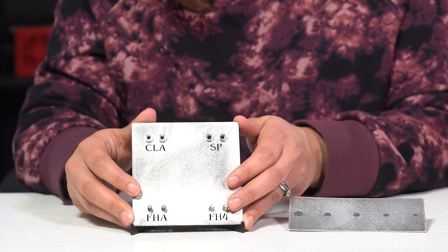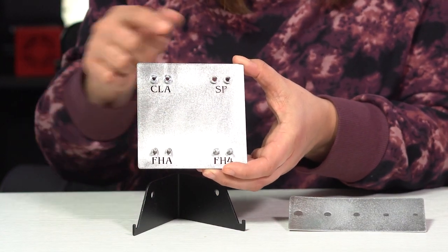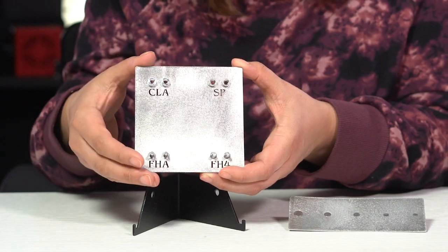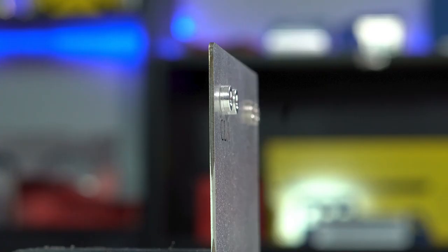If we take a look at this sample — a stainless steel panel with two nuts and two standoffs — the fasteners inserted fine during the manufacturing process and they look okay, but the integrity of these fasteners is compromised due to the material mismatch. The force required to remove these aluminum fasteners would be much less than what would be required if they were stainless material. This is why it's extremely important to have your fastener material harder than the material it's being inserted into.